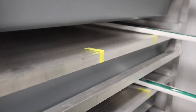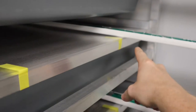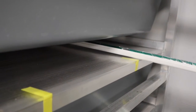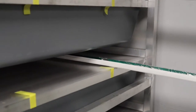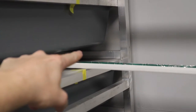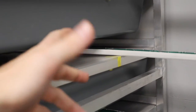At the minute I've just got tape holding the polycarbonate in place. I need to 3D print some brackets to hold that in place, and other brackets will go down here to actually hold the heat strip up closer to the tub. That way I can turn the thermostat down a bit — even though these are heating to 90 degrees perfectly, there's a gap where heat can disperse. I need to print a bracket to raise the strip so it's almost touching the bottom of the tub, which should lower the heating cost.